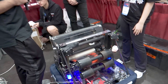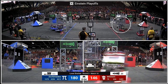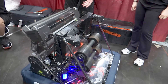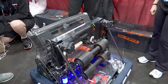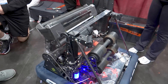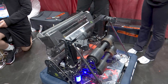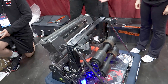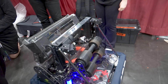Now let's talk about your climber — you have hooks over here, tell me more. Our strategy with the climb is to make it as solid as possible, so we use a ratchet system. The con is it's one-shot — once you open it you cannot close it again. But the pro is that when our driver drives directly into the chain, the only thing he needs to do is push the button, and the climb works automatically — it falls and immediately closes due to the ratchet, so we can hang the robot.